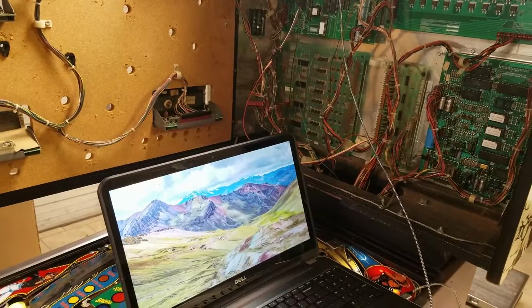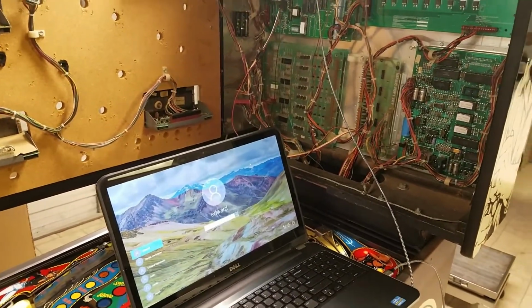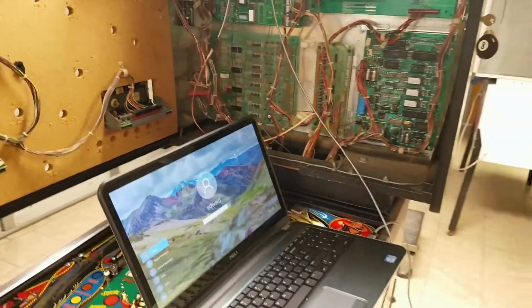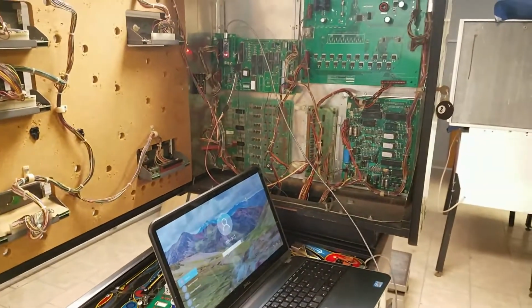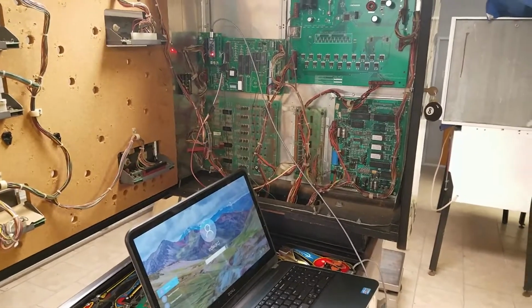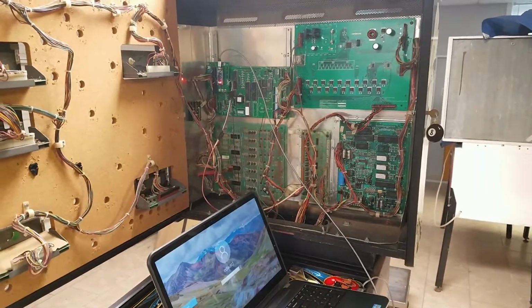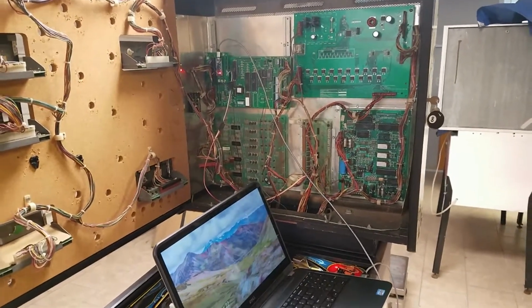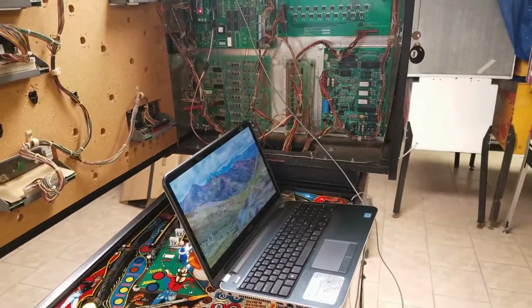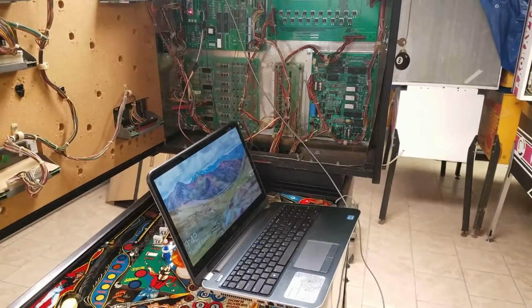Again, it's Tuesday morning. I made another minor change to my code. I took out a 200 millisecond delay. I almost never use delays in my program, and I'm not sure why I had stuck this in there, but I took it out. 200 milliseconds every time through the loop is going to basically delay most of the program time, and I think I might just be missing the relay resets. So I'm going to go ahead and log in and download my code, and I'll bring you back to see if this has fixed anything.